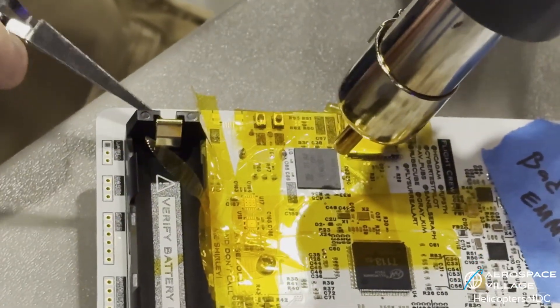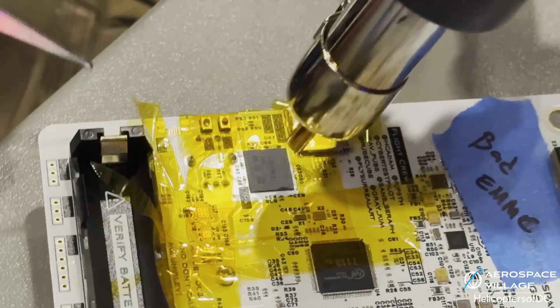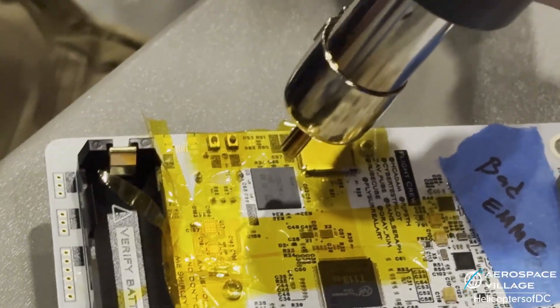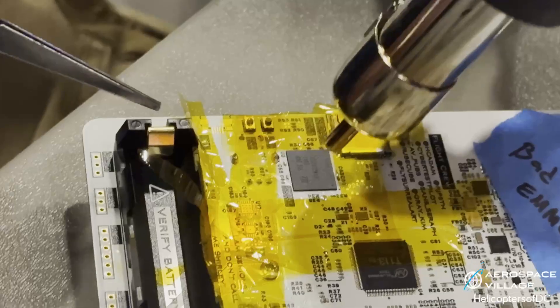It's like the battery tab — you're literally soldering a heat sink, because it's actually designed to sink not only a lot of current but also heat from battery charging, since you can do up to 3A battery charge.